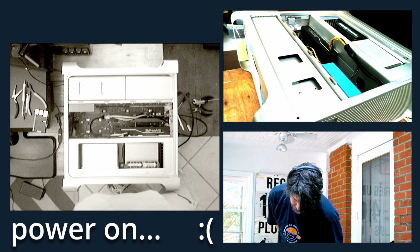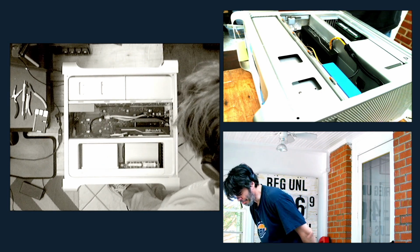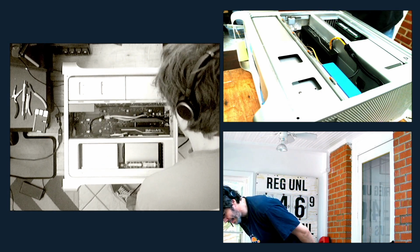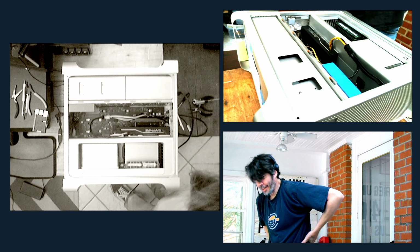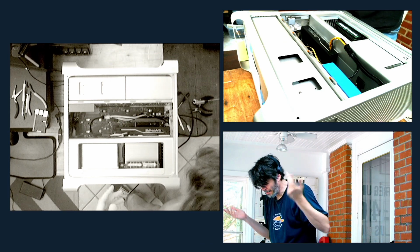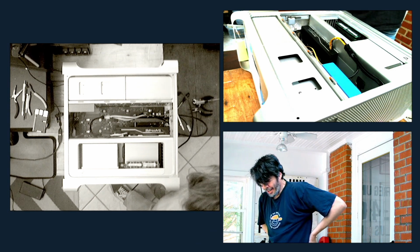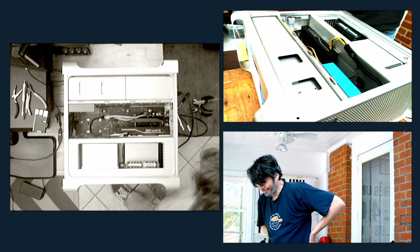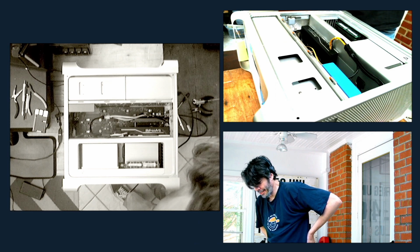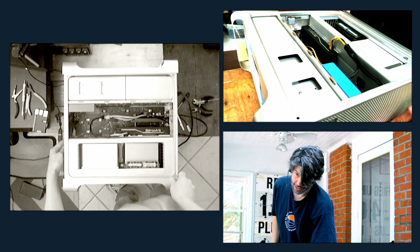And looking at the front, it's just the blinky white light. I have previously tried minimizing the system, pulling these cards out, hitting the SMC or CMOS reset button that's under the graphics card there. So we're going to have to try digging out that firmware chip, I guess.